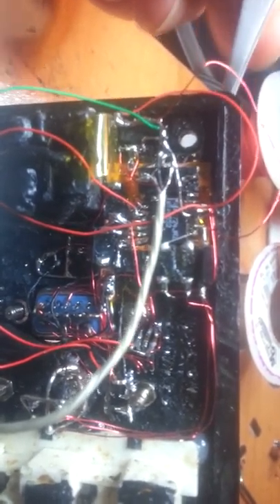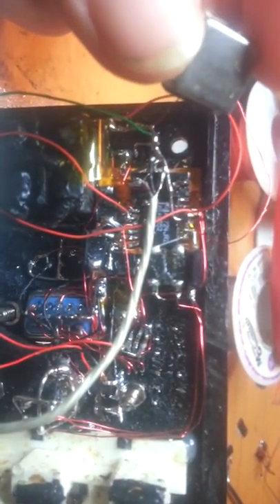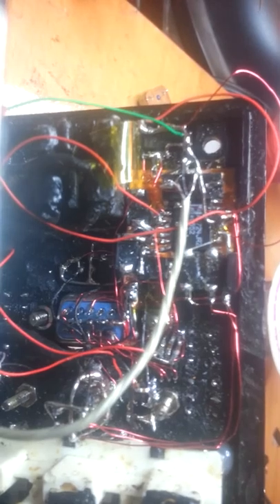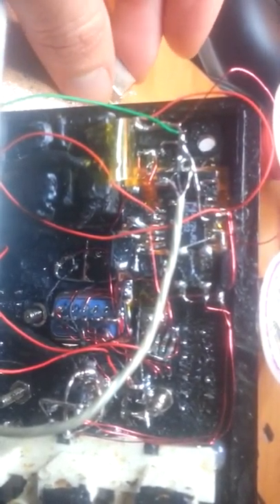Method two was a TTL CAN oscillator. These are interesting because you just give them 5 volts and ground, and they output the full 3.579545 MHz frequency in TTL pulses without any additional circuitry. I'd been using these little tin cans for years because it's the lowest part count. I always thought that was the best I could do — it matches the spec, it's the most stable frequency. But I couldn't figure out why it still had issues. I only recently realized that the load capacitance of the chip itself alters the incoming frequency.